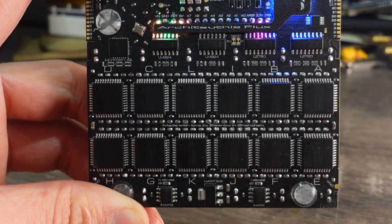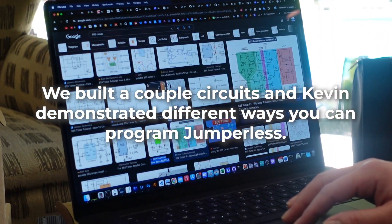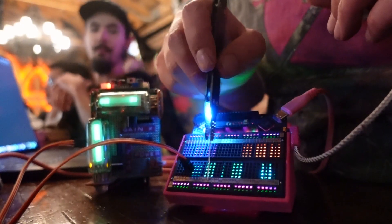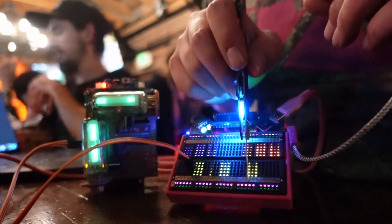So you said there are some crosspoints on the back — could you tell me a little bit about the integrated circuits you picked and exactly what they're doing? There are 8x16 analog crosspoint switches and they all have connections to one another. They are CH446Qs — a pretty obscure chip, you don't see them a lot out there. It basically works like a telephone routing network. You can plug in a probe right here and just poke out connections — you can say I want to connect that to that and it'll find a way to make that connection for you.